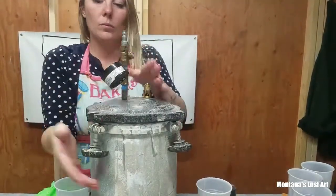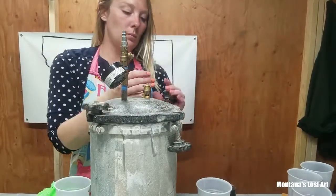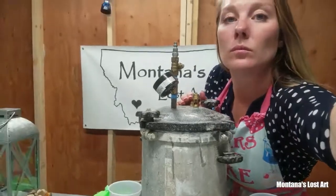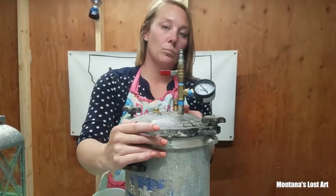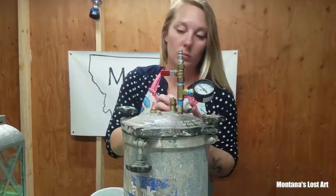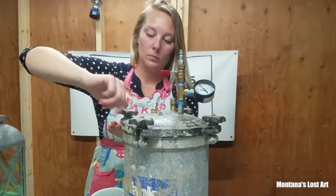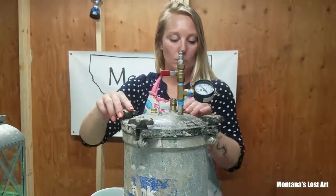Yeah, I had some company visit me during the pour, so I'm sorry guys, I wasn't able to show that on the video. But here I'm closing the pressure pot up and I'm getting ready to hook it up to the hose and the compressor. And I will get the gauge up to 40 psi.